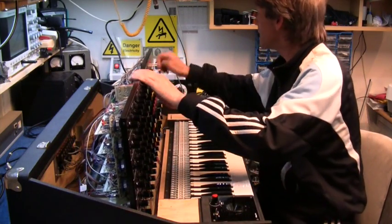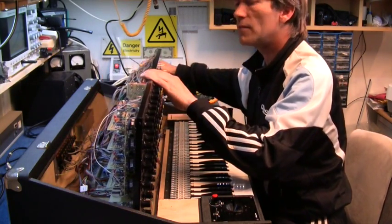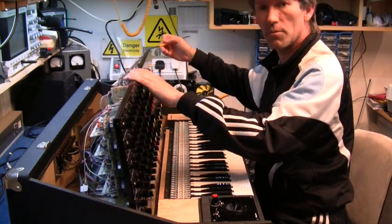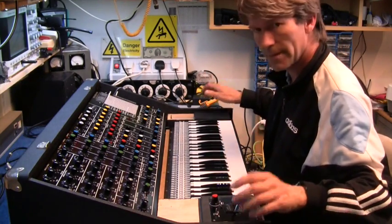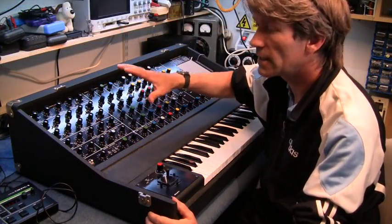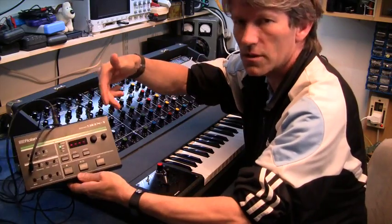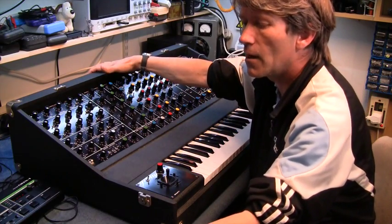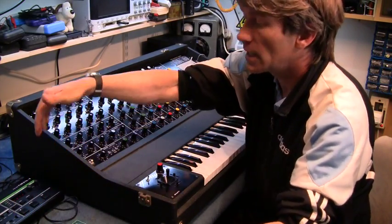Right, got sound. I'm going to close this lid back up now, keeping the audio hanging out here for the moment into the amplifier. I've ordered the TDA2003 chips — they'll probably arrive tomorrow and then I'll put the amplifiers back in. What I've got set up here now, just so I can mess about with it and get some sounds out of it: I've got one of these Roland sync boxes — MIDI going in and the control voltage coming out directly into the Maplin. I've got a TB3, which is a bass machine, but I'm only using the MIDI out, the note data coming out into that.